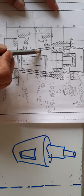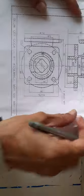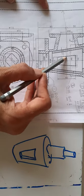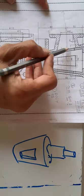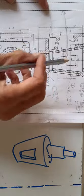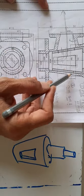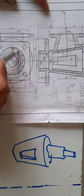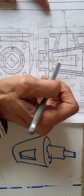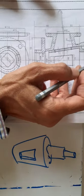If you rotate this cock by 90 degrees, the window will come to the position in front of the opening — the cutout aligns with the inlet and outlet so the flow of steam can take place. After rotating by another 90 degrees, since windows are on both sides, either cutout can come to the opening and you can open the valve. Rotating back closes it again.